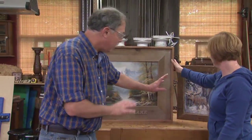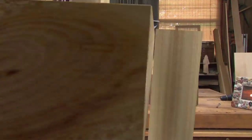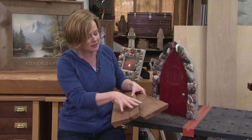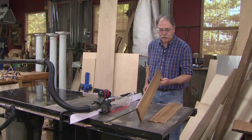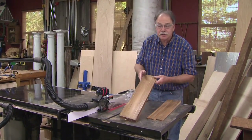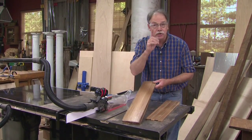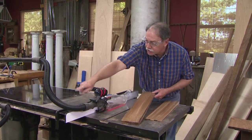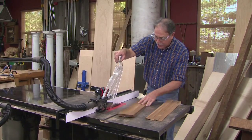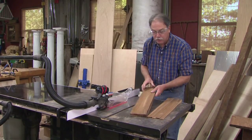Now, on to the gnome door. Let's go — this is fun! Now it's time to create the gnome door. Let's go over to Scott on the table saw and see the magic come out of this cedar shake. At the table saw, I'll turn on the dust collectors because this cedar has toxins in it that stop it from decaying — you do not want to breathe that. This guard has a chute in it to help pick up the dust off the top of the blade, and the blade is no more than a quarter of an inch above the thickest part of the wood.